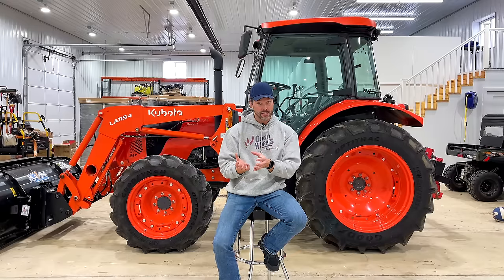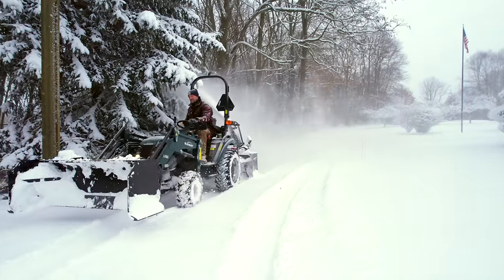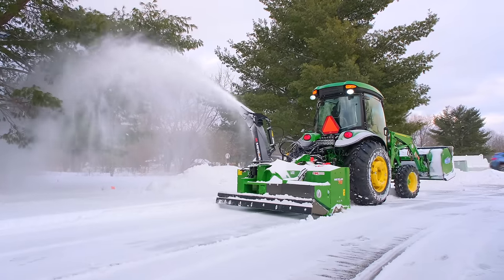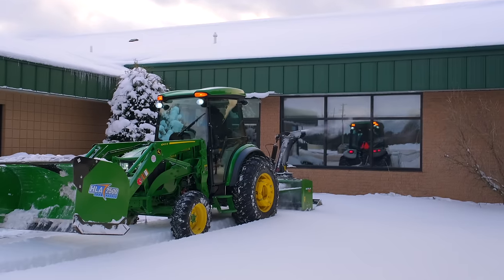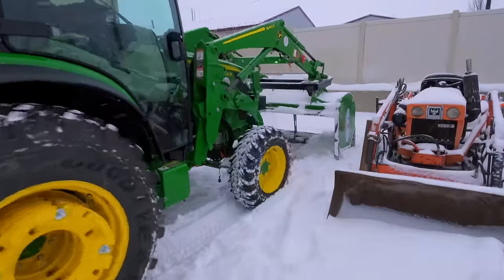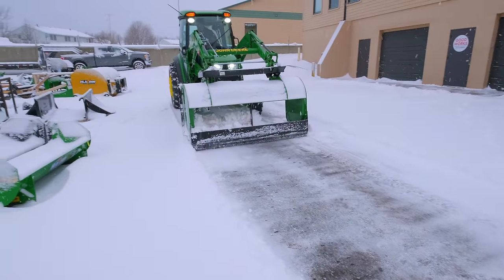On the flip side, that wouldn't fully explain the R3 turf, so there's something else that has to come into play. That's where all the little grooves on an R14 come in - those little chunky areas. An R14 or VersaTurf is a hybrid tire. It takes the other three tires in this survey - the R1, R3, and R4 - and takes the best properties of all of them combined. You see that from the turf tire with all the little squares or rectangles that are on there, with all the edges helping that tire get grip. All those little chunks on the R14 are all little edges grabbing and helping it propel forward. The R4 industrial tire doesn't have that - it's just got long bars on there.